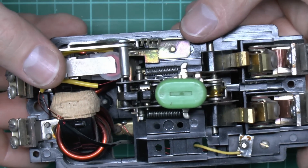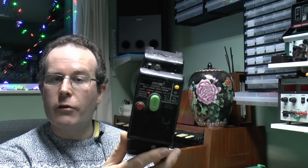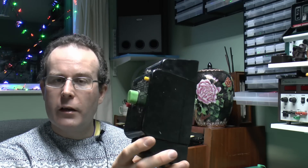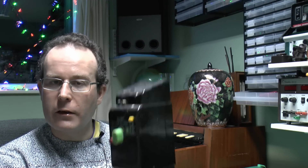So that was a look at the Chilton Earth Leakage Circuit Breaker Type E — current operated, not voltage operated, with a tripping current of 500 milliamps, which is considerable compared to the modern standard of around 30 milliamps. Interestingly, the test button doesn't create a current imbalance via the resistor — the resistor just limits current through an additional coil which directly creates the magnetic field, as if there were an imbalance, and that's picked up by the sensing coil to trip the solenoid and switch off the supply. A strange way of doing it, but it works. Until next time, thanks for watching.